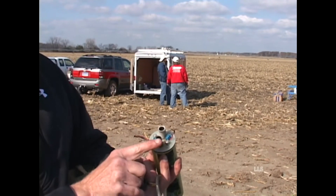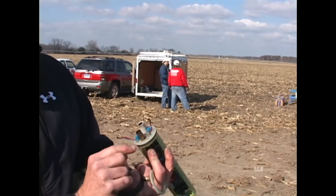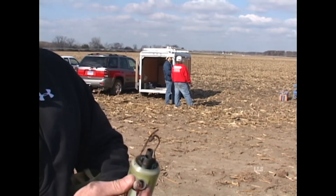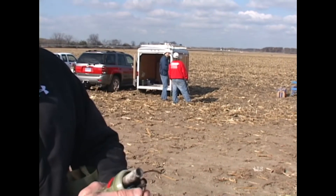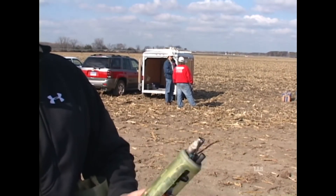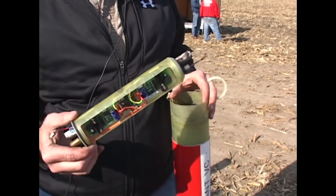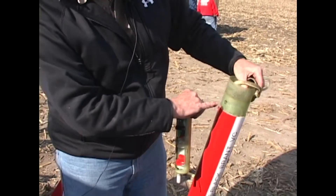What I've used for the charge holders is a .45 caliber brass casing bolted in, with a small piece of PVC that slips over the top to give a large enough volume. I just replace the PVC and clean everything else up. Once assembled, the electric match just goes inside and it's packed and taped. There's a double O-ring seal at the top and a single O-ring at the bottom.